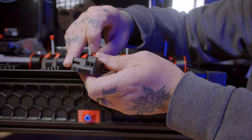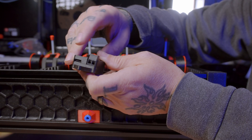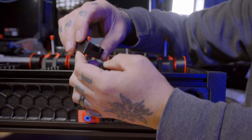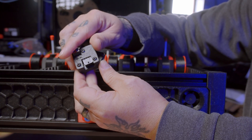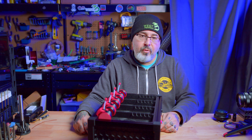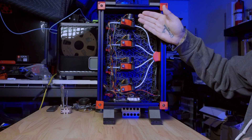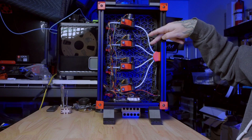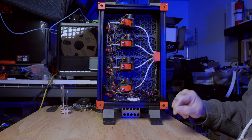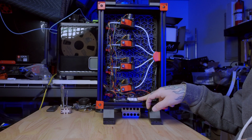We're going to use this adapter board from the LDO Motors Nighthawk USB toolhead board kit. It has power input and USB input, and then a Molex 6-pin output on the other side. I'll use the cable from the Nighthawk kit to get power and signal up to the Box Turtle and then terminate it in that connector. Looking at the underside, we have our four extruders here. All of them output through PTFE tubes into the hub. We have the AFC light board at the bottom, which is the controller for everything.